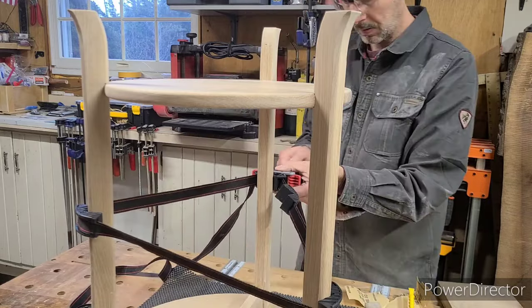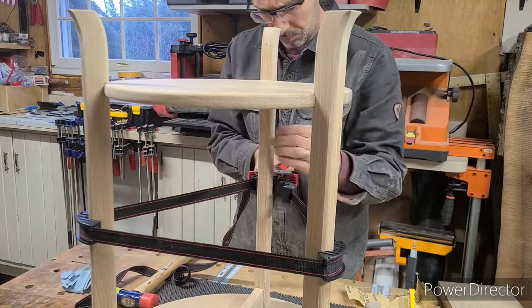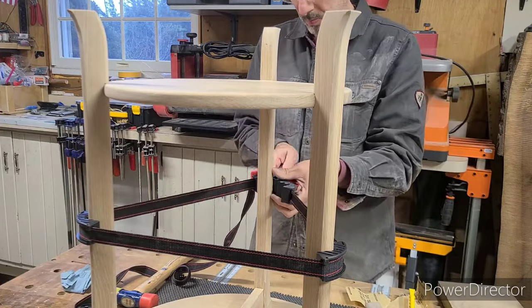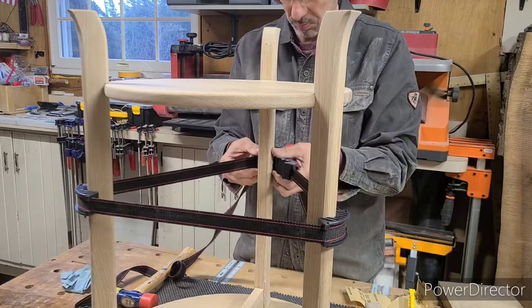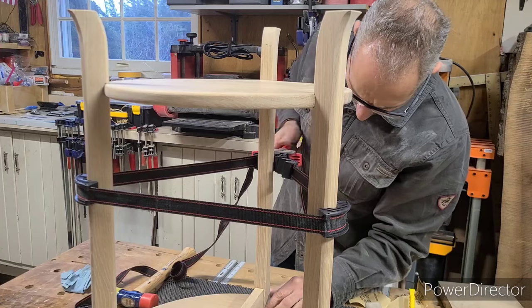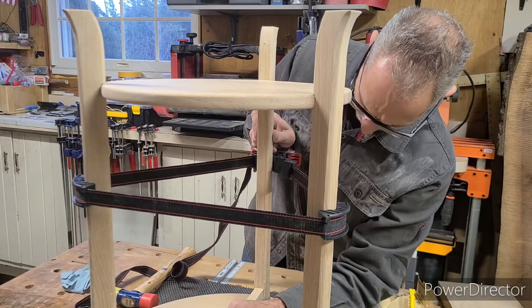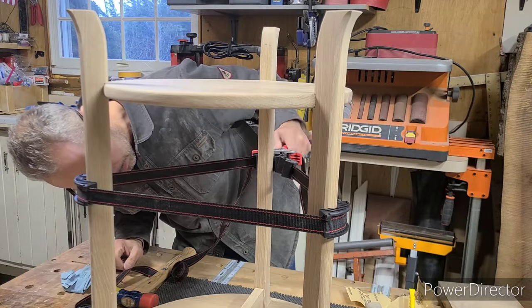And now I'm putting on the picture frame clamps, and this was a bit tricky too, because it wanted to torque everything out of square. So you had to be gentle with the pressure, and once I had it holding, then I was able to go back and add my 90 degree squaring blocks so that I could square everything up nice and straight.